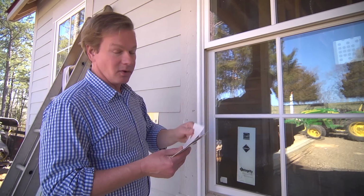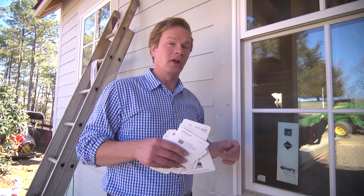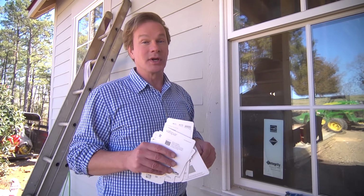and I think I'm getting pretty close. Now, what you want to do when you paint is you want to make sure that there's not much moisture in the air if you can. If you're painting in the fall and the early spring, you can have really extreme changes in temperature. So you want to make sure you're painting when it's above at least 40 degrees. Otherwise, you're going to end up with a really bad paint job and you may have to redo it.